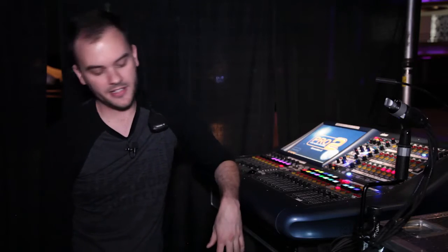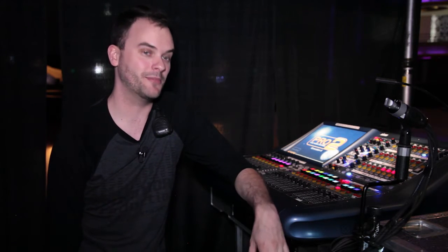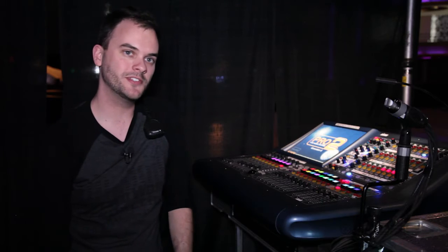Signal-wise, there is an analog splitter between the two. Now that they have the new box, the DL231, I want to switch to that for the next tour so we can do a total digital split — no analog patch needed besides what's happening on stage. But right now it's two 251s sitting in here, one in each rack, with an analog splitter right between the two, and then Cat5 going out to front of house — four pair of Cat5 with a spare line just in case.